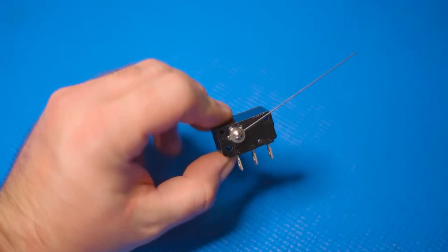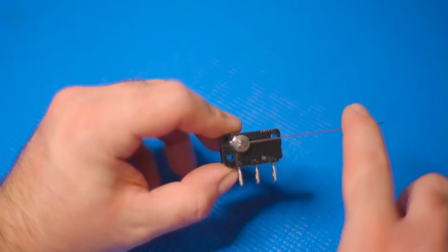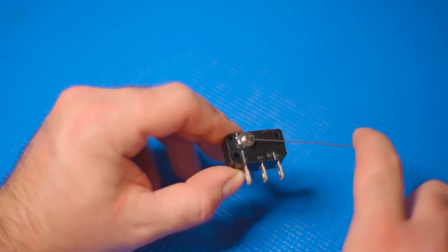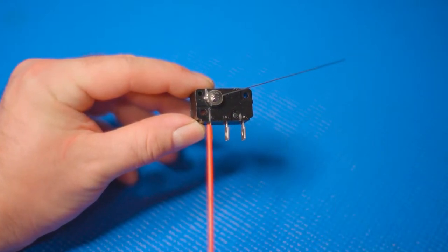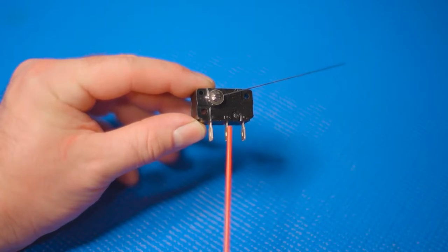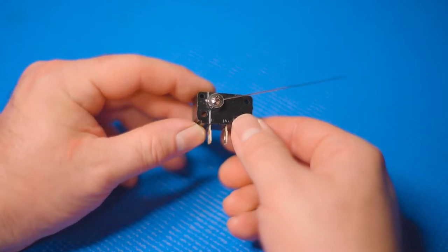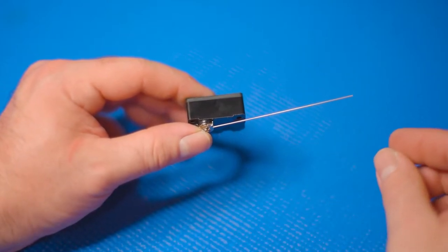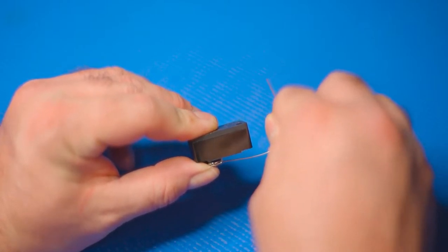What you're going to need is one of these coin switches. These come standard in the larger SuzoHap style coin mechs — affiliate link in the description. You will need to connect the common and the normally open, marked NO, to your USB encoder the same way as any other arcade push button. Then configure this button as your coin input in the emulator settings instead of the coin acceptor.